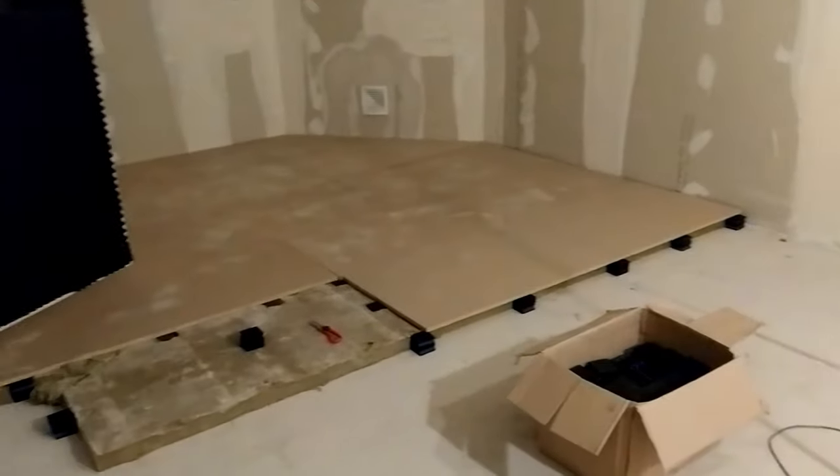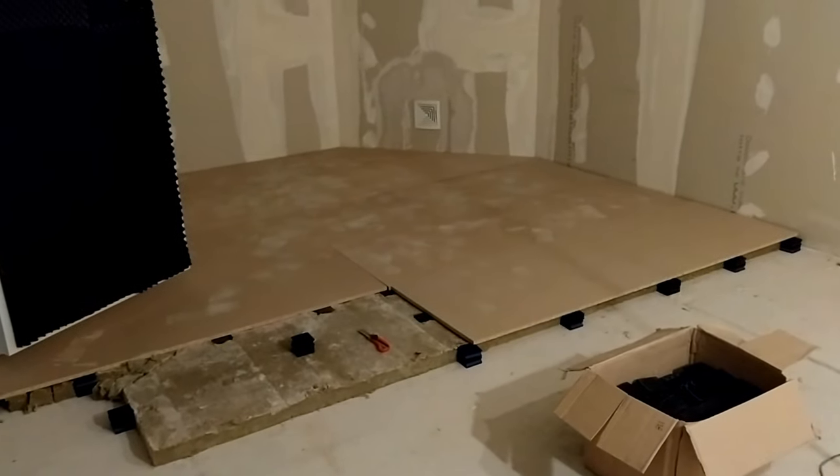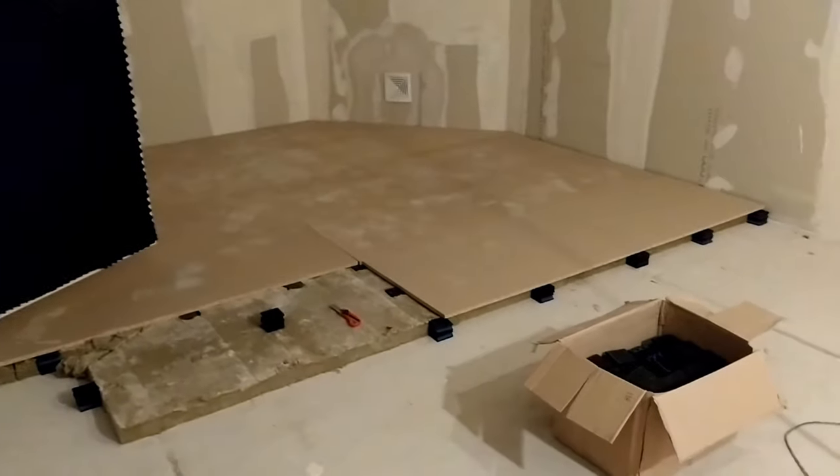It was hanging from some springs from the existing ceiling. Regarding the floor, because we couldn't safely do a reinforced concrete floating floor since this whole studio is on the first floor, we opted for a lighter construction which consists of three layers of MDF seated on top of rubber pads and rock wool.